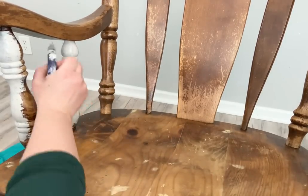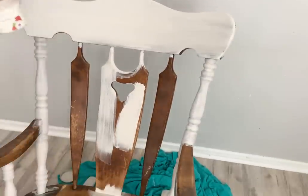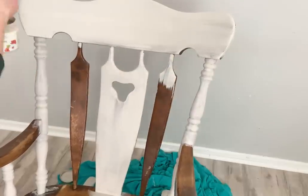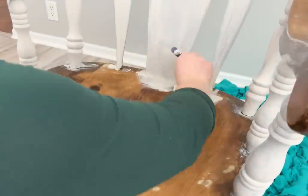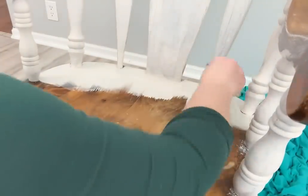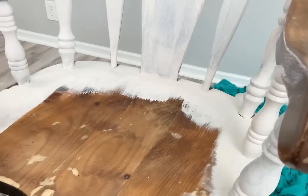This is clay-based so it's really easy to use with your water mister. When doing a rocker it's kind of tricky — I would stay in sections. I do the bottom first, then the spindles, then the front part of the back. I want to leave the armrests for last because I'm going to use them a lot to turn the rocker over while it's wet. I just paint around the spindles on the base, then the midsection.